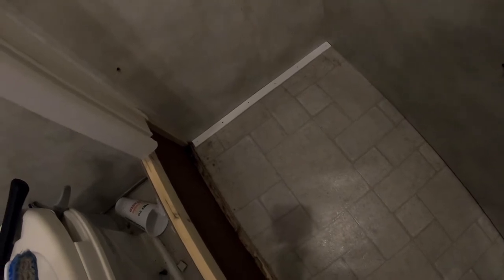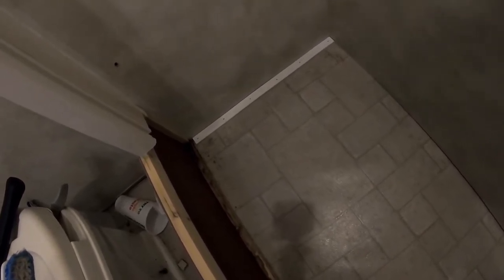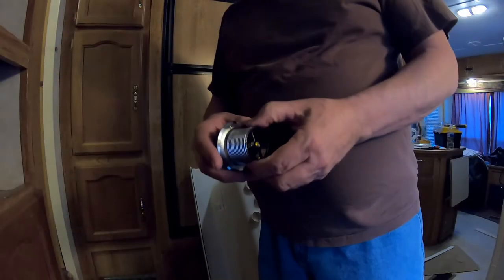I've got to clean all this up and do some little repair work — try to nail that linoleum back down. Here's my solution for the linoleum that was rolling up: it's just a piece of quarter-inch by one-inch plastic trim that I got from one of the local stores. I took my heat gun and warmed up the linoleum so I could get it to lay down, and then I tacked it down with a couple of brads. Hopefully that'll hold in place — unfortunately I'll never know if it pulls up or not because once I get this tub in here it's going to be semi-permanent.